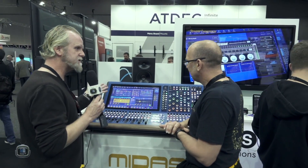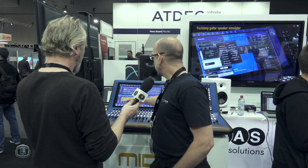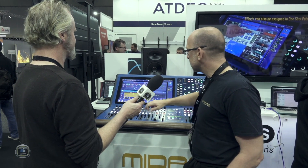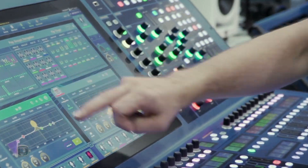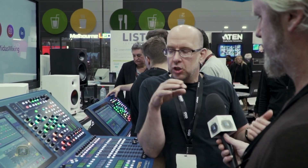So what interesting features have we got here, Pete? So here's an interesting one — it's called Audition. What you can do is adjust the EQ in the monitor bus only, but not at front of house. So if you want to make an adjustment for someone on stage and you don't want anyone to hear it — maybe take some nasally stuff out — you don't want to sweep the frequencies with everyone looking around at you. You can do that in the monitor bus and then quickly apply the changes. You can also do that with scenes, so you can preview the EQ in different scenes ahead of time, adjust it, and then transfer your EQ either back or forward. Hugely powerful stuff.